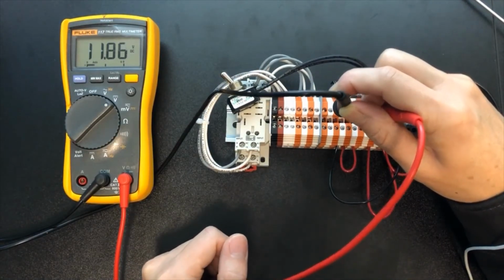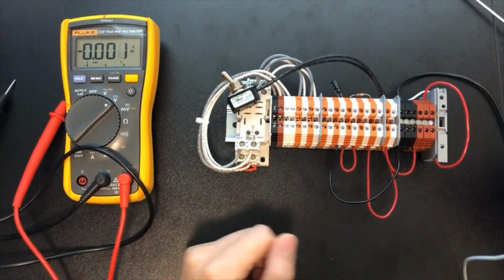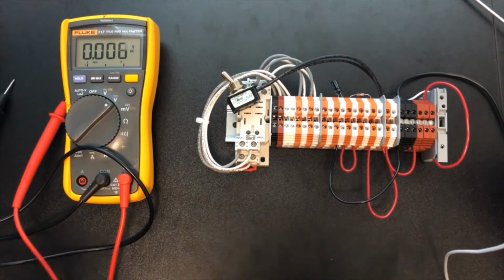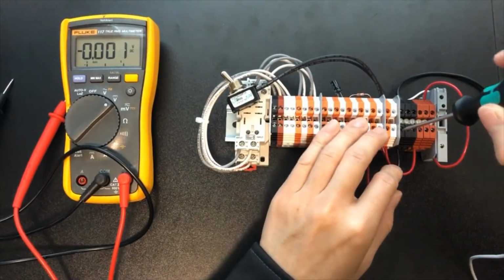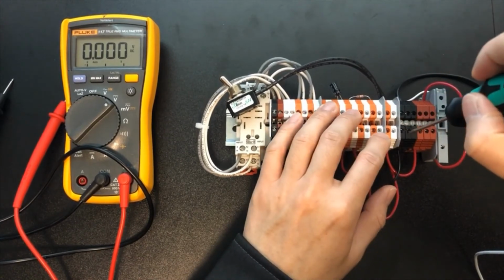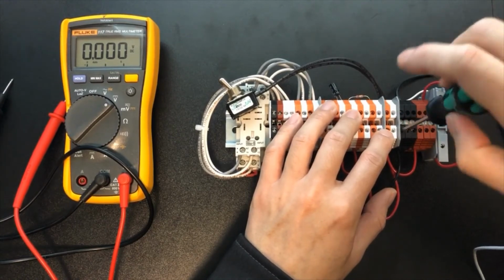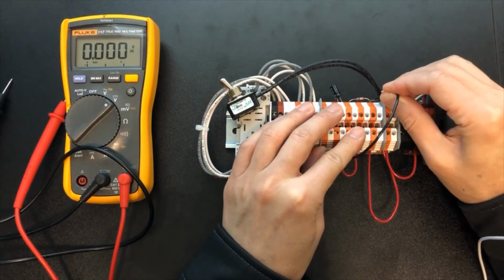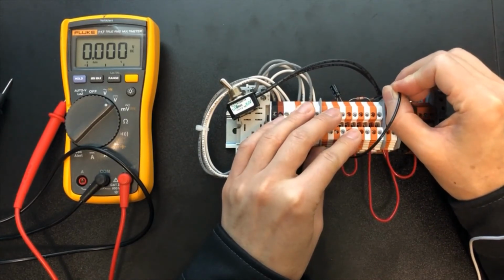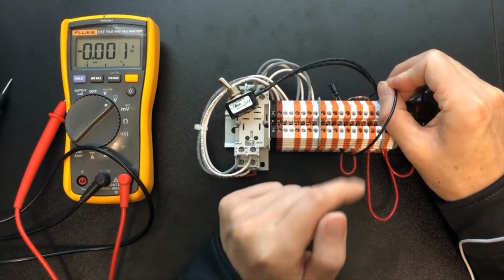Right. Now, I want to show you how to discharge this capacitor. If you look at the handout, you need to build up this circuit. The easiest way to do it is you take off the negative terminal from the power supply. All right, take this off and put it on the resistor, right? The terminal that is a little bit far away from the capacitor. And now you just connect there.